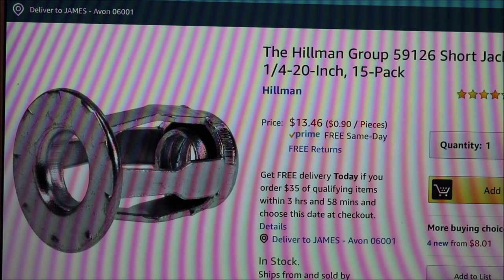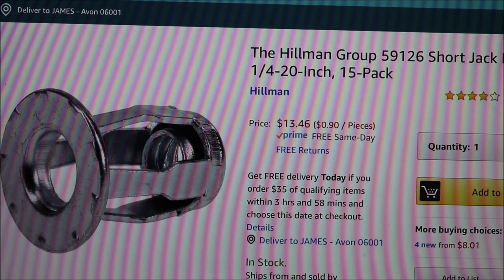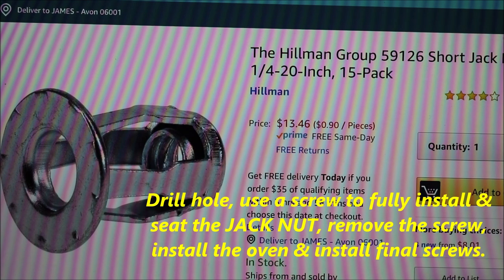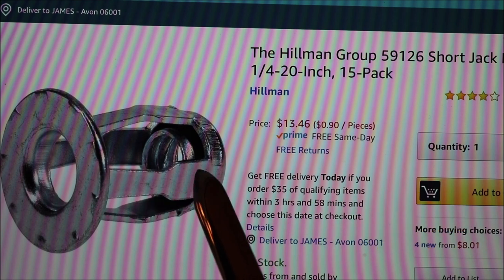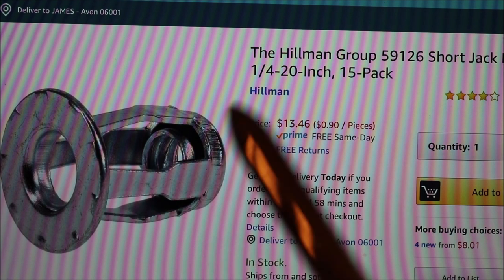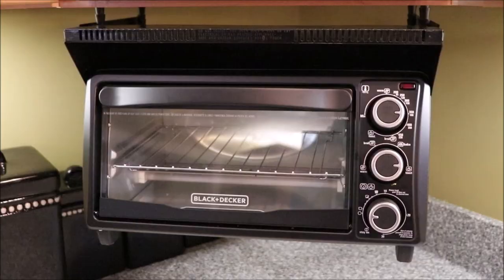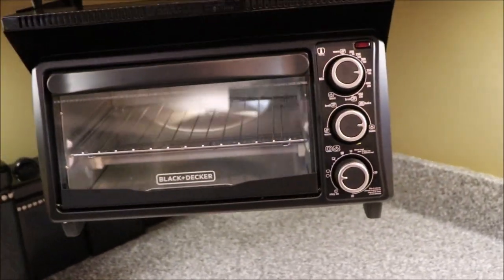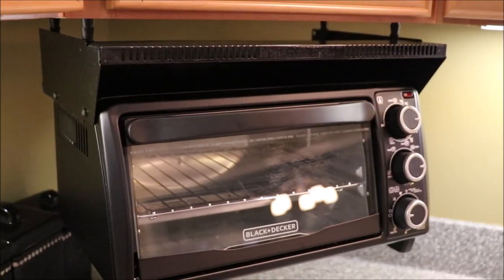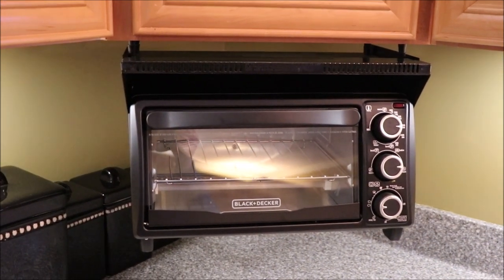You could also use something like a jack nut. This quarter-twenty example is way too big, but the idea is: you drill a hole in the side of the enclosure, insert the jack nut through the hole, and when you put your screw in and tighten it up, this section compresses and becomes very short, giving you a set of threads without relying on the sheet metal thickness. Here's my finished product — it keeps the oven off the counter and saves us a little space. Again, this is just to show you what I did; I'm not recommending this — proceed at your own risk. But it did solve our problem, and some of you may be interested in this approach. Put a thumbs up or subscribe if you found this at all entertaining or helpful.